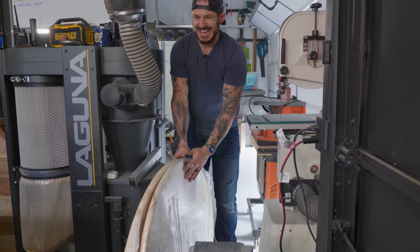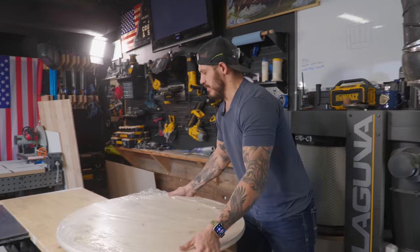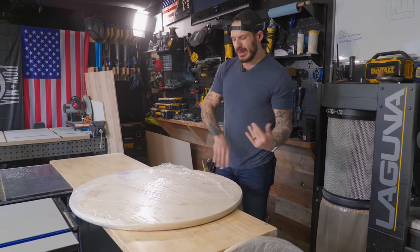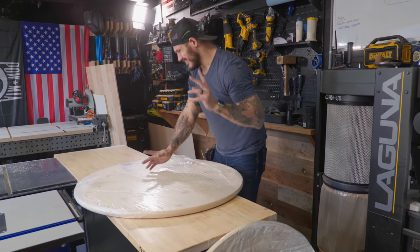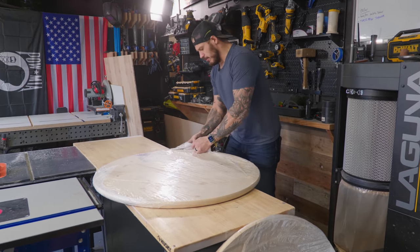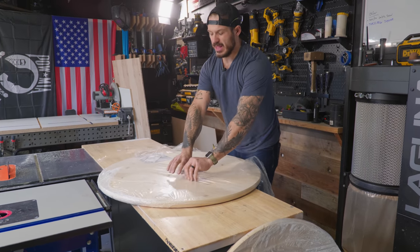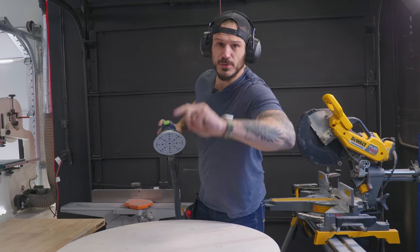All right, while the dowels are drying, we gotta start handling the preparation of these tabletops. These are allegedly already stain ready, but we gotta get everything down to 220 grit. Though the top is nice and smooth, the sides are a little grainy. So we'll take this off, give it a quick light sand all the way down to 220, and then we'll start doing the stain stuff. Tool number 2, the sander.